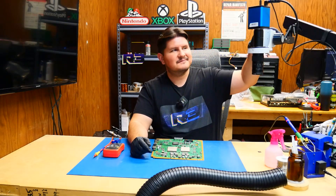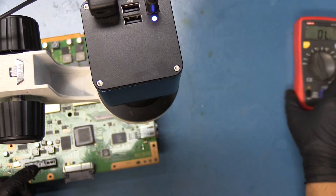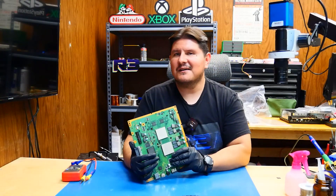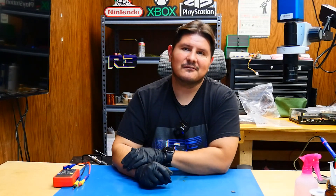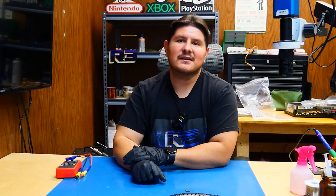We've reattached the chip. Let's go ahead and see what that diode is doing. I believe the culprit was right over here. Looks like we're no longer shorted. Looks like we're good to throw this back into the console. And there we have it — a fully functional console. No longer outputting only via the multi-out; we actually have HDMI functioning. It's amazing how just a tiny little chip will cause you so many problems. If you found this video helpful, please remember to leave us a like and subscribe. Thanks for watching, until next time.